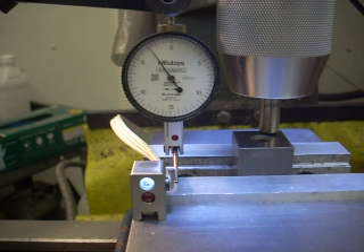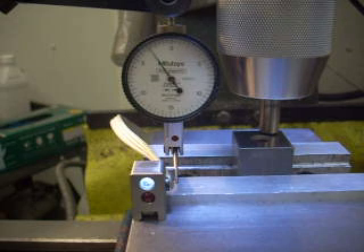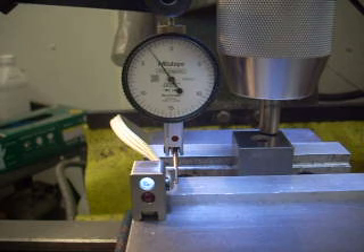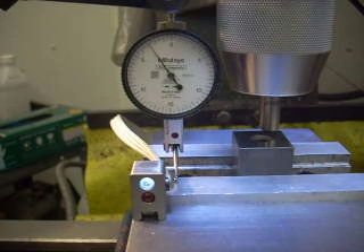This edge finder is good for machines that have a spindle resistance greater than 2 ohms. I have another one that's good for spindle resistance down to 0.01 ohms — a little harder to use, but it does the same thing. Although this edge finder was intended for the lathe where there is no other option for electronic edge finders, it does work on the mill just fine, and in cases like this maybe actually has a cost advantage. So that's all for now.